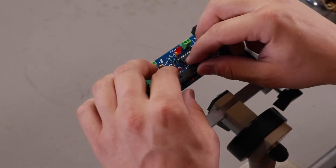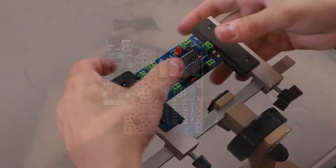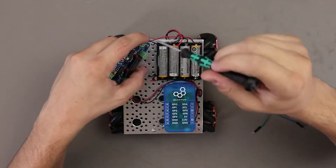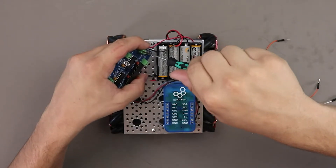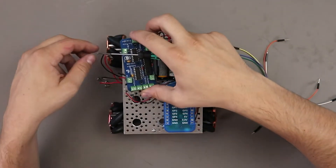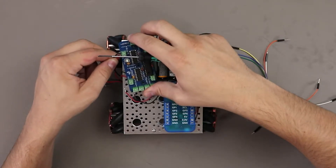Once you have finished soldering the PCB, you are now ready to connect it to the BuilderBase. Let's start with the terminal labeled J1. This one connects to a 4.5 to 6V DC power source to provide power to the PCB and the Quantum BuilderBase. The power can also be cut using the switch and the LED indicates the power status of the entire board.